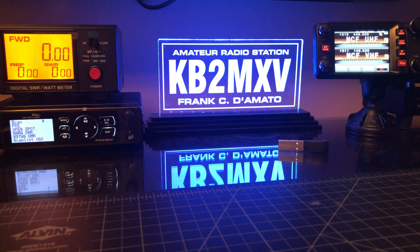Okay, here are the readings for my FTM 400. We're going straight to my watt meter and my antenna. National Calling Frequency VHF 146.520, high power. Let's see what the meter says: 48 watts, SWR 1.28.